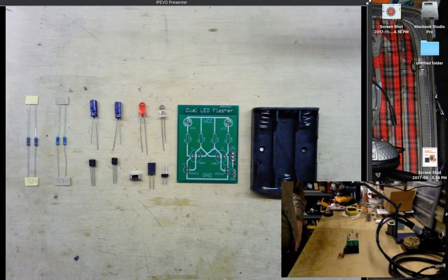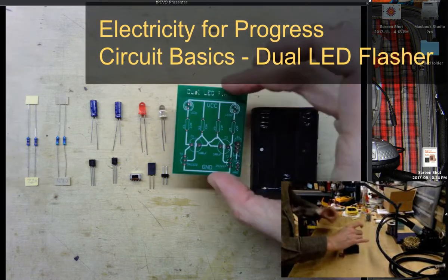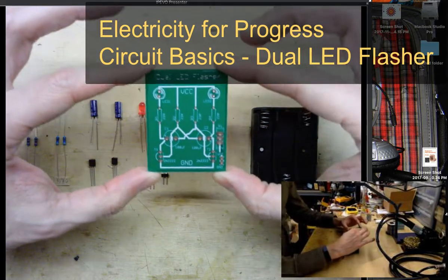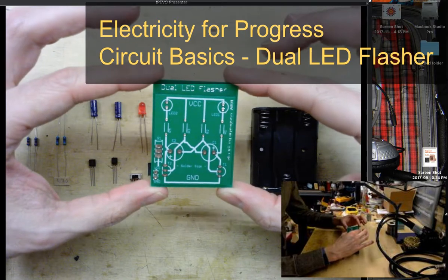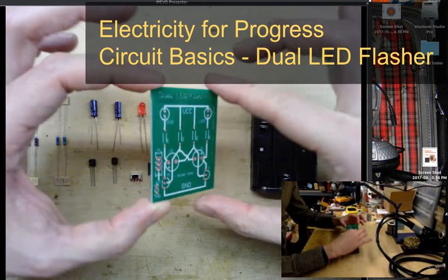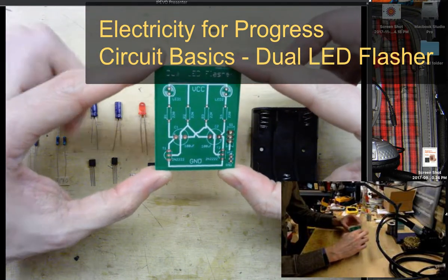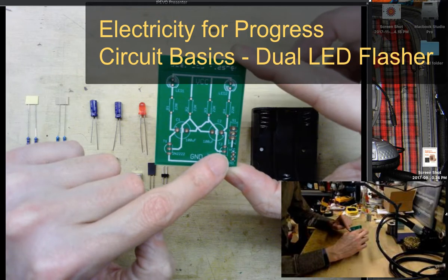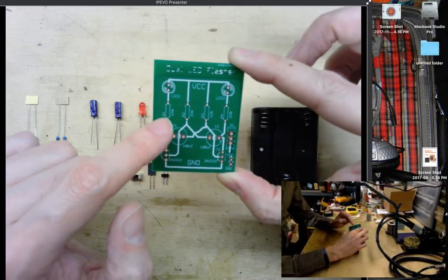Today, we will be exploring this simple circuit, the Dual LED Flasher. This is the first in a series of Circuit Basics projects that I will be doing. This particular circuit flashes two LEDs using two NPN transistors, two capacitors, and 4 resistors.